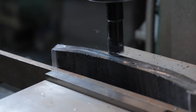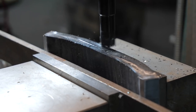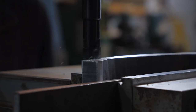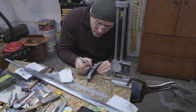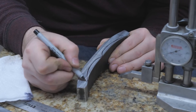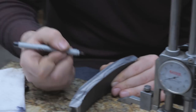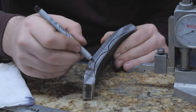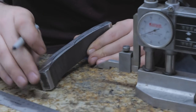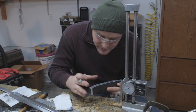I went ahead and milled the sides of the guard so I could do layout on it and have it sit square with everything else. I drew a line a quarter inch down because I wanted this curve to come up about a quarter of an inch to a point. Then I drew lines up here to mark where that radius needs to end on each side — matching on both sides. I should be getting close to taking out this big chunk of material and getting the face of the guard shaped. I want to make sure I do it in the right process and get it all even.